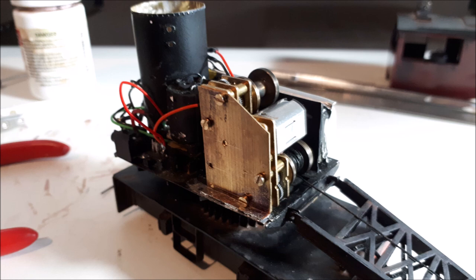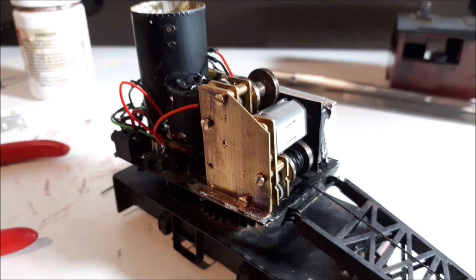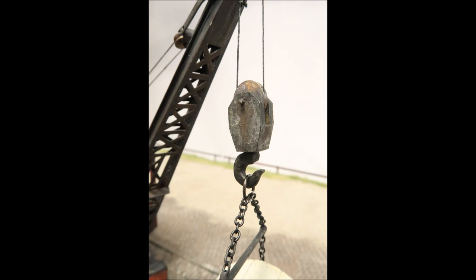These gear motors were then mounted to a side plate I had soldered onto the crane bed for the purpose. If I remember rightly, I was able to tap the spare holes in the gearbox 10BA with no problem. They were the correct size for tapping as supplied. The hook needs to be as heavy as possible in order to fall under its own weight.